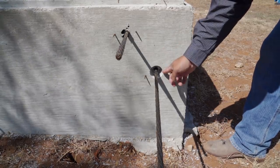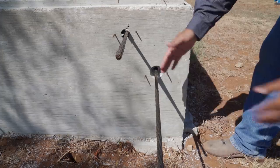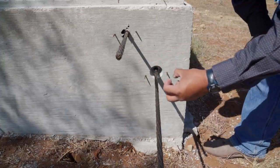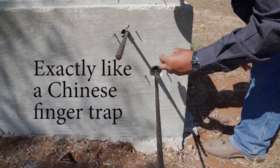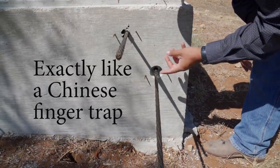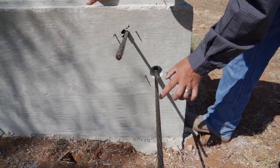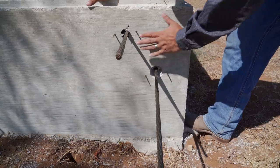They attach the machine on here, it stretches that cable out, and it pushes those wedges in. That anchor has a cone in there and those wedges are a mirror image of that cone. They stretch the cable, and when they release it, it tries to suck the wedges in, but because they are in a cone, the harder it pulls in the more they compress around the cable — that's what keeps the cable in place. Whoever comes out to stretch the cables will measure a foot and paint a mark, then stretch the cable to whatever specifications the engineer calls for.